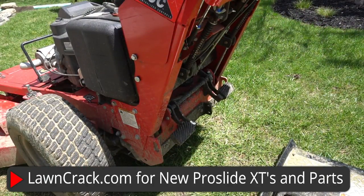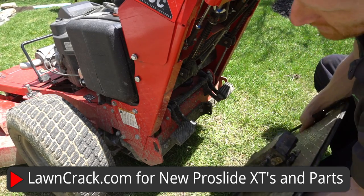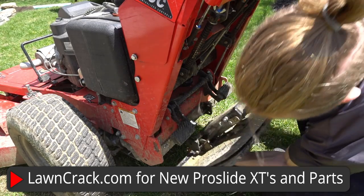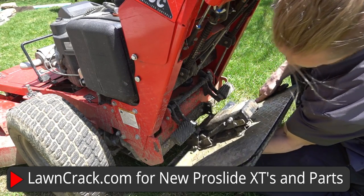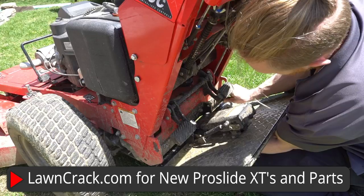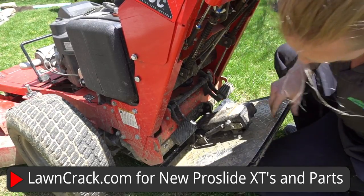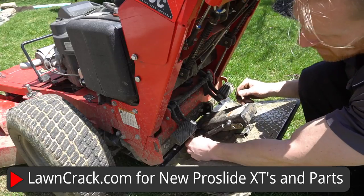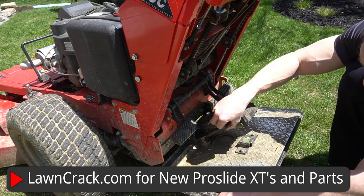The lighting situation isn't the best but I did want to go over how to get this back on, because I remember the first time I tried to do this I could not figure it out. It has this little lip right here on this metal piece that is going to catch on the bottom of the bracket installed on the mower. What I like to do is get your knee or your arm down here, slide this post right on through there — just like that. And as you can see the pro slide is back where it should be.